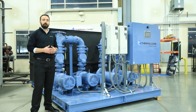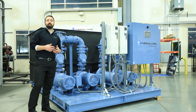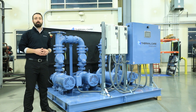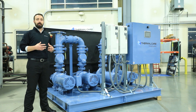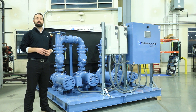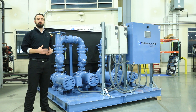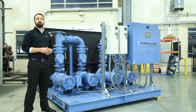They're all wired with liquid-tight, weatherproof conduit. That way, we ensure that they're protected from elements even if they are still installed inside. The pumps are available with ODP or TEFC motors, which protects them from harsh environments. All the motors are premium efficiency, which means they can all take a VFD application. The construction of these is built to resist corrosion — to do that, we use stainless steel or fiberglass for the reservoir.